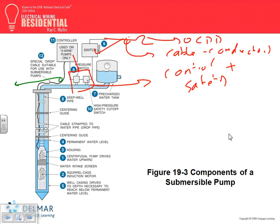They gather all this sewer system into a well, a lift station, and then they put pumps like this, and it pumps it all the way, if geography is not working, if topography is not working, they pump it all the way to the wastewater treatment plant, where they process it. They're all over, guys. If you look around the cities and you see a little controller on the side of the road, most likely underneath is the lift station, pumping the sewer system to a different location.